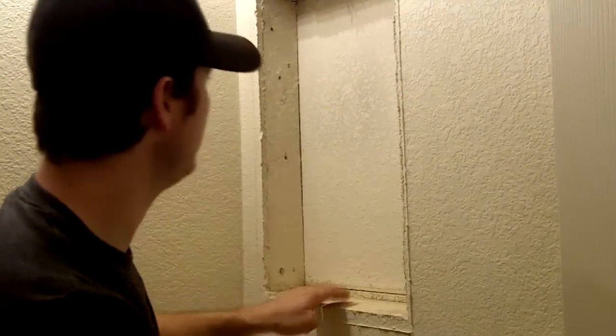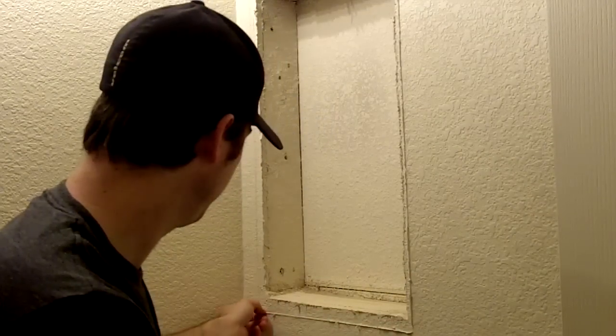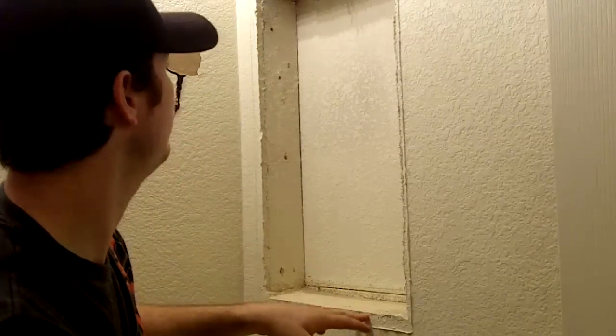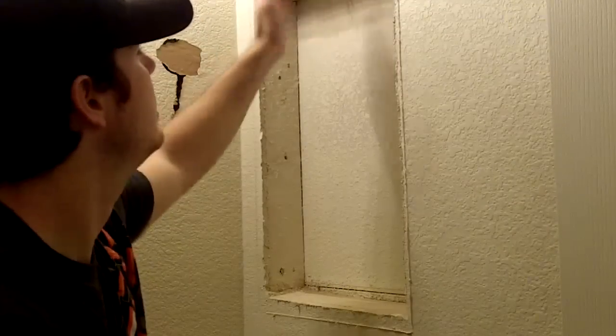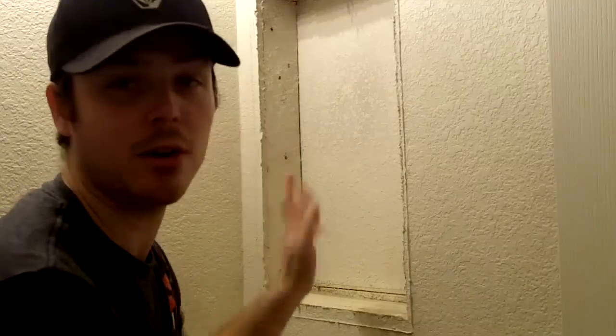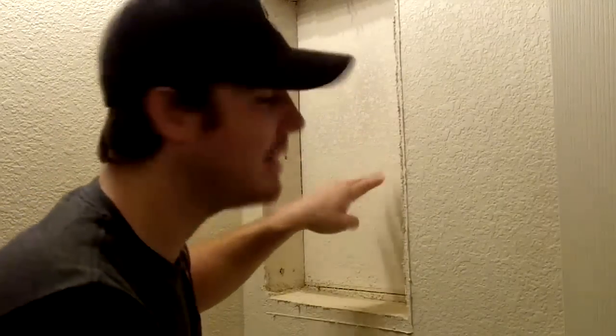So I'm going to measure from here to here, take that measurement, and go to Home Depot and say this is the measurement I need — they'll cut it. I'm going to pick up one of those 2x2 pieces of drywall. If it's 3 feet I'll just use the 2-foot piece and cut some off. The reason we're putting this stud in here is so the drywall has something to attach to — you can't just put a sheet of drywall in there and say it's fine. So we're going to measure here, go to Home Depot, get the stuff, and we'll be right back. We're going to install it today, and next video we'll teach you how to mud, tape, and texture it.